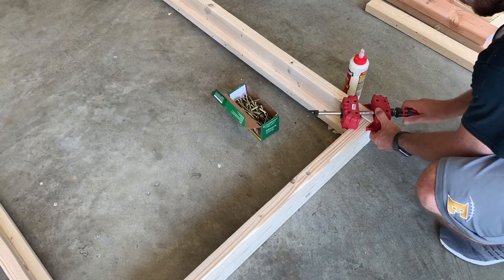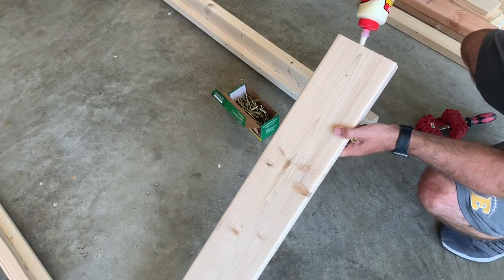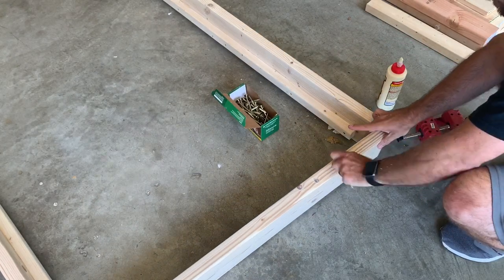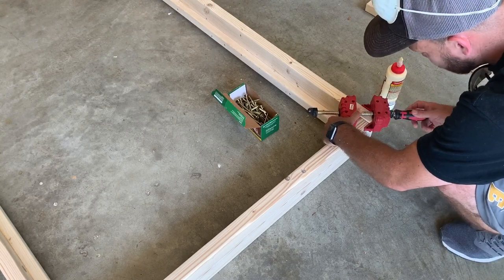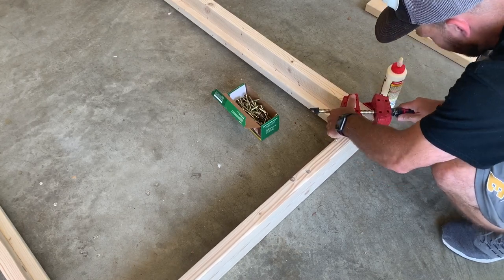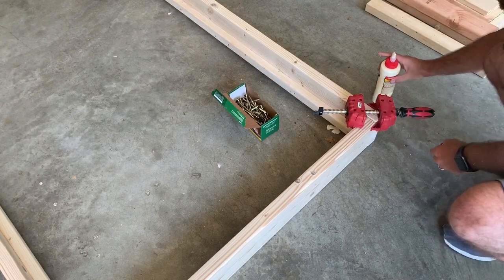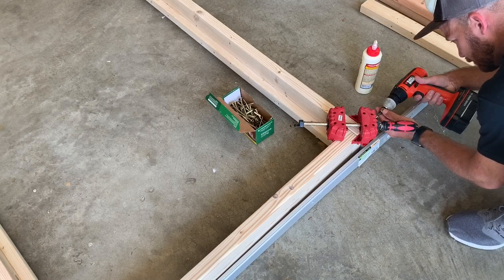This section gave me a fit or two. I was using self-tapping lag screws — interior screws meant to not need a pre-drilled hole. But as I found out on this first corner, pre-drilling is still best, particularly when going into the end grain or into a section of the wood that's close to the edge. So after this one, I pre-drilled the rest and had no problem. Even the splitting that did take place wasn't a big deal — it was slight, and these end rails are not supporting any weight; they're really just keeping the front together. The screws I'm using are interior lag screw replacements and they're three and a half inches long.